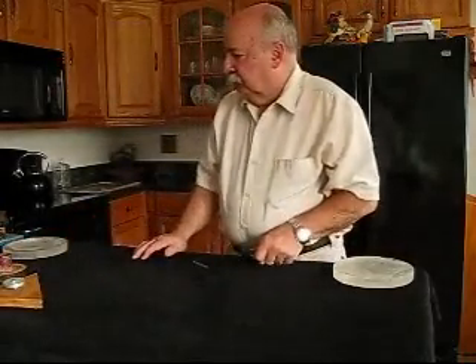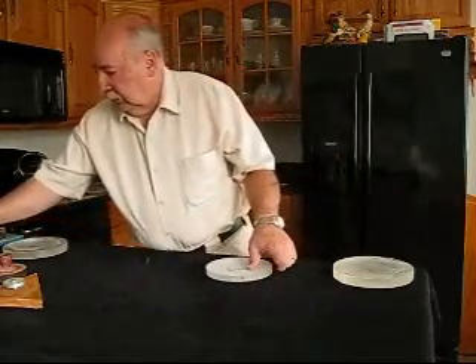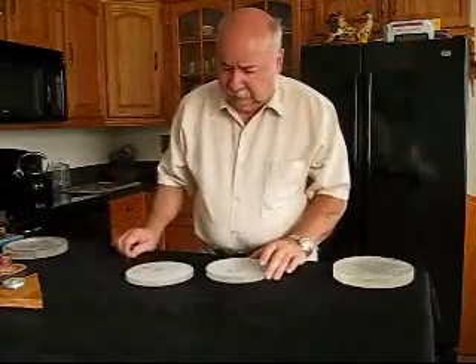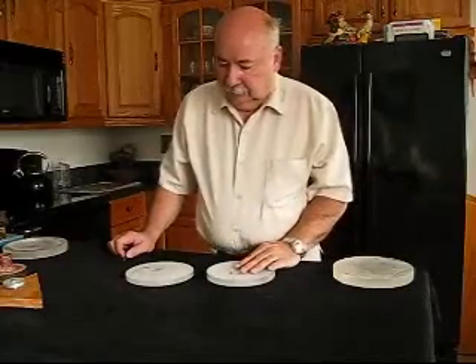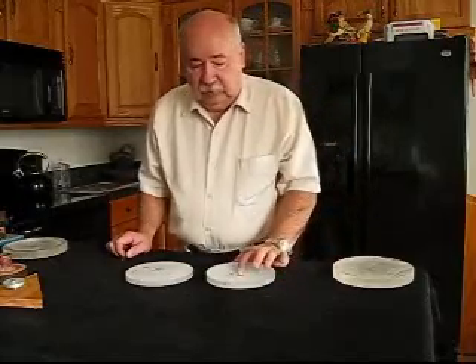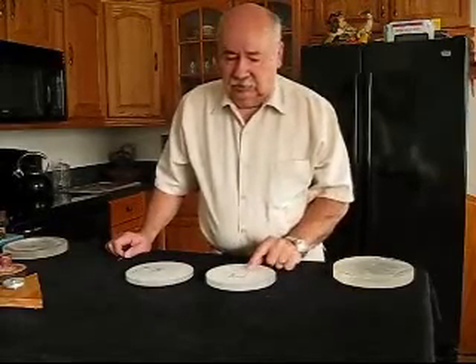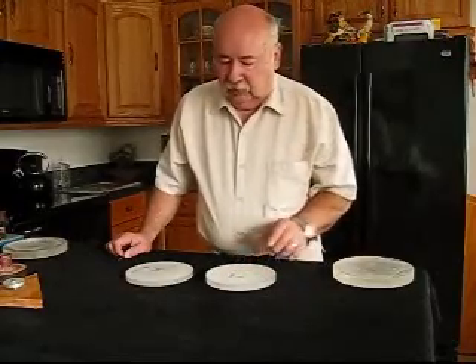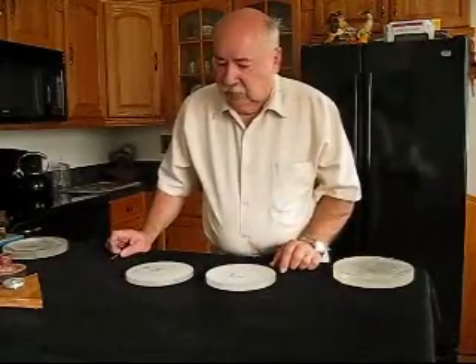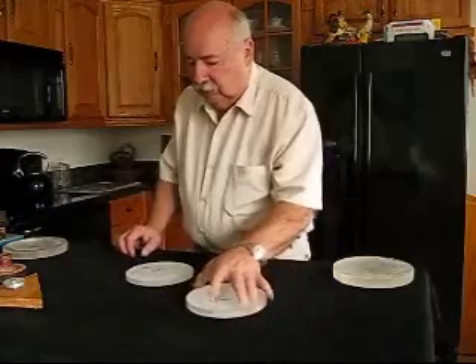I mentioned lenses. Here are a couple of refractor lenses. They're really doing the same thing — you're generating a curve on these. But with lenses, you have to be concerned with center thickness and wedge. Because if you're working to a certain prescription, you'll need to know what center thickness is. Lenses have to be free of wedge or it causes a lot of problems. So you'll need some way to measure that.